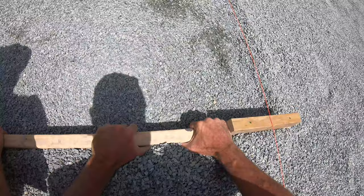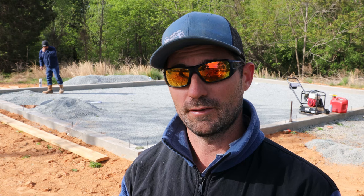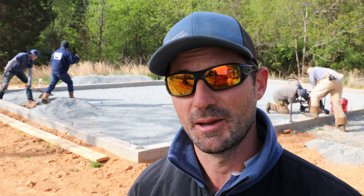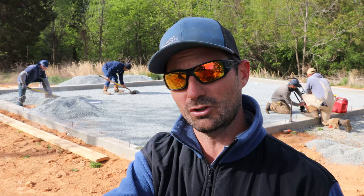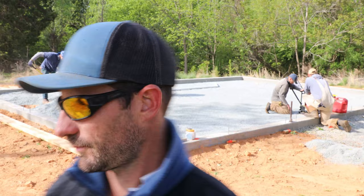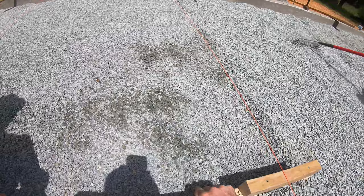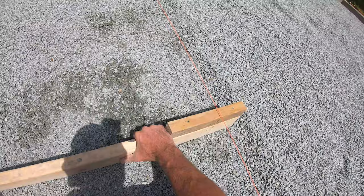This really is a key step to under slab preparation and it only takes about an hour and a half — no longer than just raking back and forth. It's much faster to get close and then screed. As you screed, you'll make a pile of gravel, so it's really nice to have two people screeding and one person raking gravel away — that makes it go really fast. You can keep an eye out for any low spots under the screed board and rake gravel in to fill those, then re-screed. Sometimes it takes a couple of passes to get it exactly right, but it's time well spent.